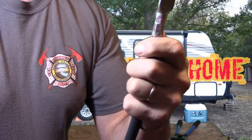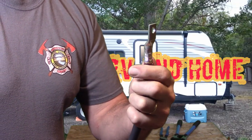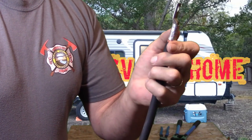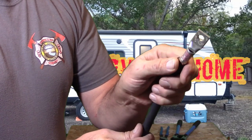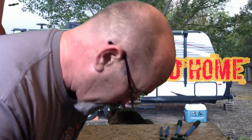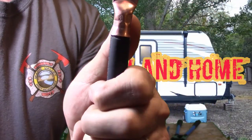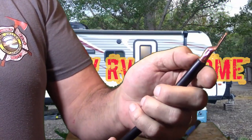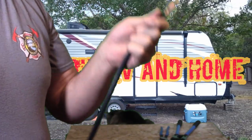Here is that final one — the tin-coated lug, which is more designed for AC electrical work in houses and residential use. It's got less strand wire. As you can see rotating it around, there was really no pinching — a nice crimp. And there is actually — let's see if I can show you — right there, it actually says '1-0' stamped right there. So it stamps the gauge size into the wire. And even on the 4 gauge one, it's not as noticeable, but it definitely has a 4 on it.